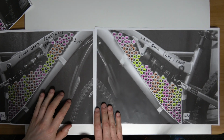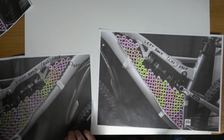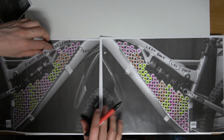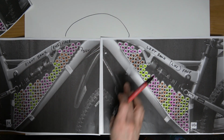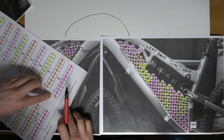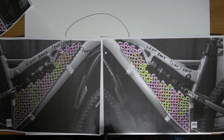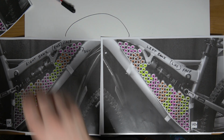So this is the outside of both banks. My series connection now will run from this point, seen here, to this point, to this grip. So that is the 11th string and the 10th string connected together, seen at this point. See the way both ones are purple there? Working out very well here. I'm trying to keep it as simple as possible.